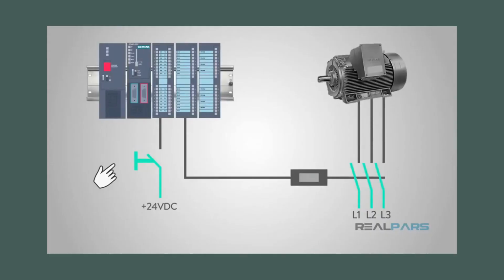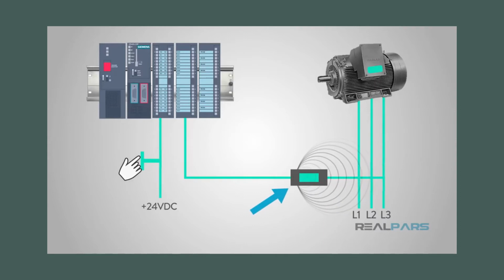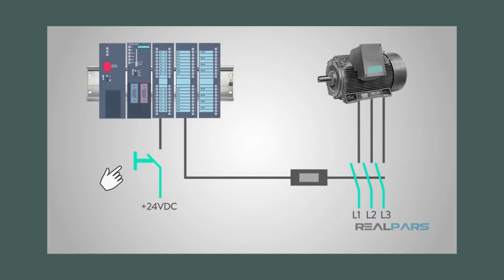In a common relay system, you would push a button to energize a relay, which in turn will pass current through a set of contacts that close when it's energized. There are many common everyday items that use a relay to operate. We'll dive into those in a minute. But first, I want to talk about why you may need to use a relay system.